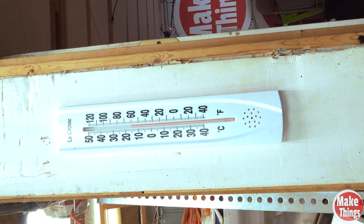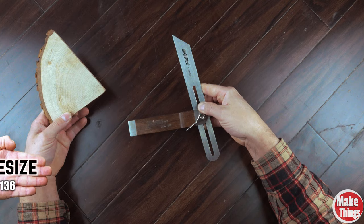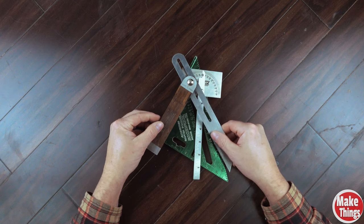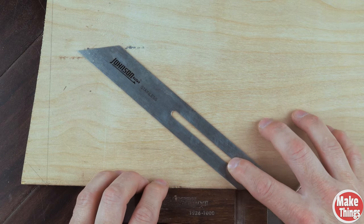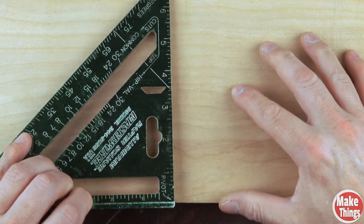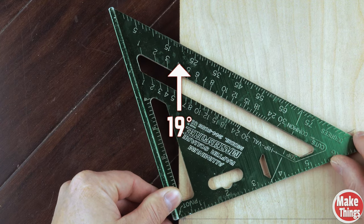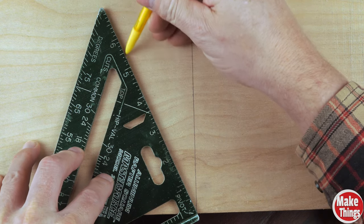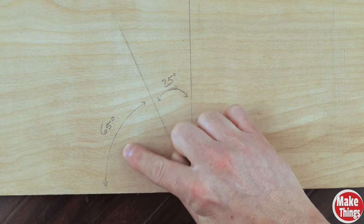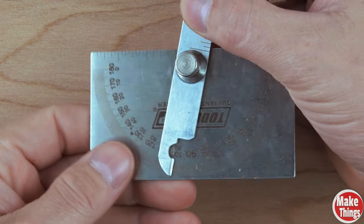Unless you're looking to duplicate an angle, bevel gauges on their own are very limited. Used in conjunction with a speed square or a square head protractor, they are an invaluable tool. Let's say I want to find 65 degrees from the edge. With the speed square, I'll use the pivot on the corner, line up the hook of the square to the edge, draw a 90-degree line, and pivot using the degree markings along the edge. If I draw my line with the pivot at 25 degrees, the angle between my 90-degree line and the pivot line gives me 65 degrees from the edge.